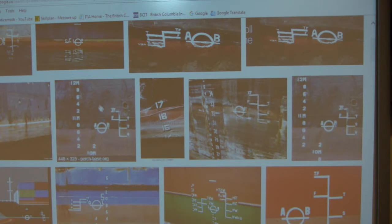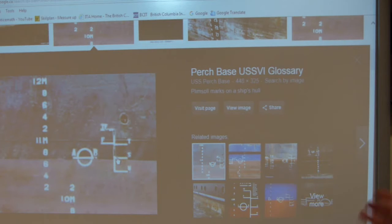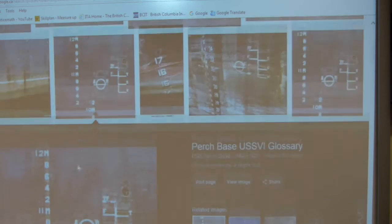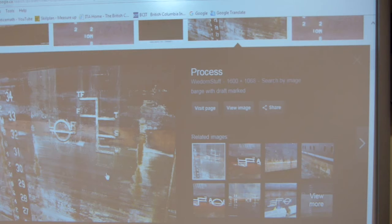What I have here is a bunch of numbers — those are load line markings from the hull. You have your typical marking that the insurance company puts on the hull: the circle with the horizontal line across. That lines up with the summer load line markings, indicating the maximum draft — the maximum depth the hull can be covered with water. Even if you sail with less load and are well below the maximum load line markings, you still have to make sure the vessel is level port-and-starboard as well as fore-and-aft. This is the trim calculation.